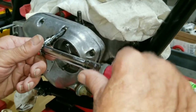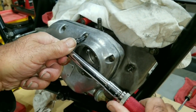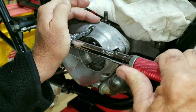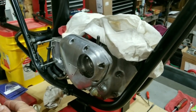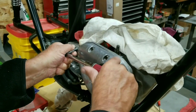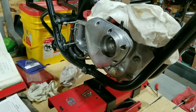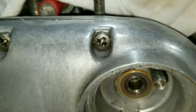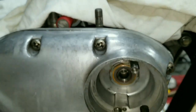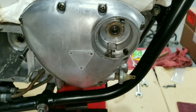We're going to torque these down — a quarter-inch screw is suggested at 96 inch-pounds or 8 foot-pounds. We'll use the handheld impact hammer — a couple of taps should lock it pretty good. Stay tuned while we work on tightening these up.